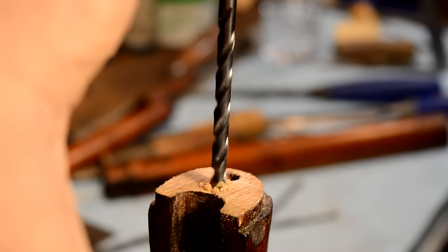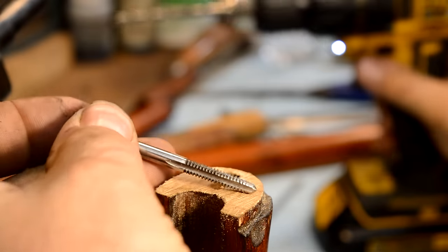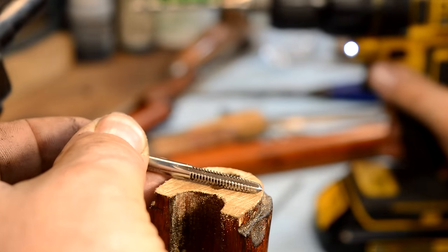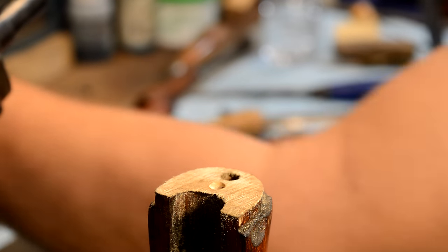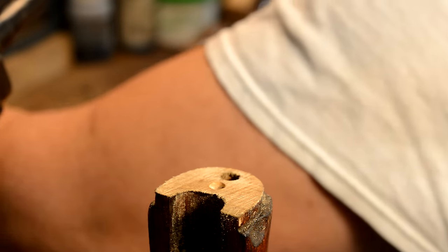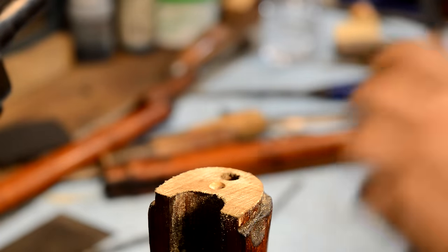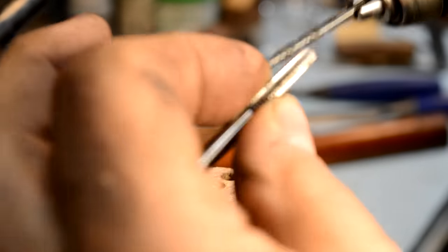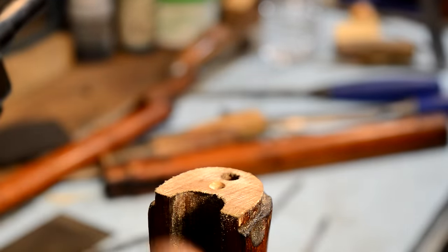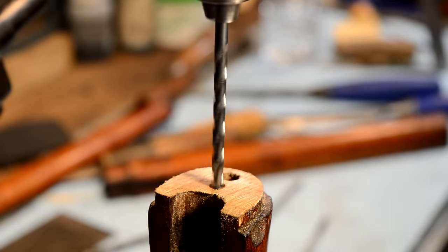We're going to split the difference here. Go right down in there and then do an idiot check on whether or not that's right. And I gotta tell you, that drill bit's a bit big. So the time to find out that drill bit's a bit big is before you got that hole run all the way down and you're running out of threads here. So I know what the charts say, but I'm looking at that and going, yeah, we're cutting through wood, this isn't steel, we're gonna be all right. So we'll do it this way here. Let me reach up over the top.